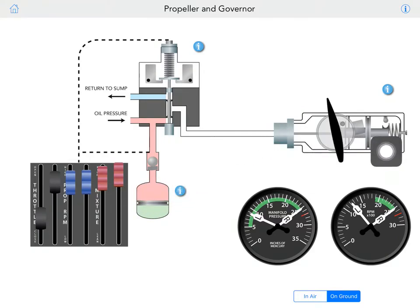So you guys know, this system will have the sump right up here, engine oil driven pumps right up here, and then this is the accumulator, for the 2000 model of the PA44-180 horsepower only, not the 79 model. The line goes through the propeller governor, that's the governor, and it goes to the hub, and you have the propeller here, and you have a nitrogen loaded piston, and this thing right up here hanging is the fully feathering pin.